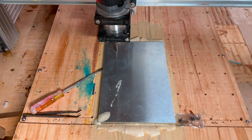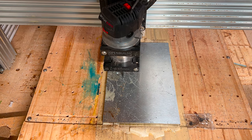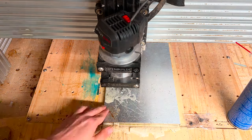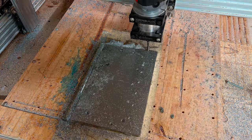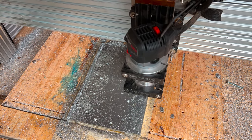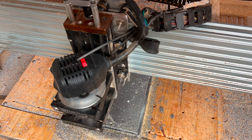Also introducing the star of today's show: CRC cutting oil. It's a nice foam that's also very sticky, and it's used to prevent stalls. Whenever you're cutting metal — we have a metal end mill cutting aluminum, which is still a pretty soft metal — whenever you have metal-on-metal contact you need lubrication. Cutting oil is specially formulated to allow the end mill to pass more easily and to evacuate chips, though this stuff is really sticky so those little chips got stuck absolutely everywhere.